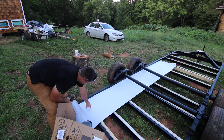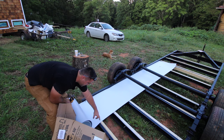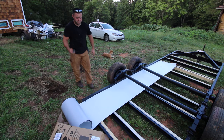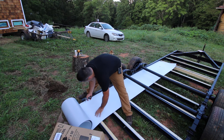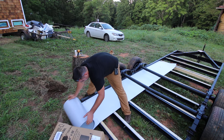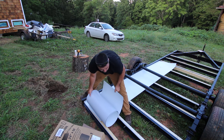I'm going to tape this joint, but I'll come and put one screw here. I will not put a screw at the edge — when I overlap it, my overlap piece will get a screw in it, which will connect into this one as well. It looks like I'm going to need three pieces, so I'll do that side and then do the middle. How do you cut this stuff? With a utility knife and a framing square. Just score it with a utility knife, then bend it back and forth and it'll snap.